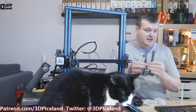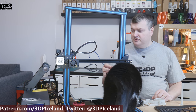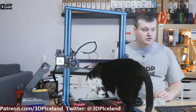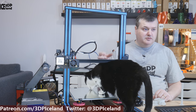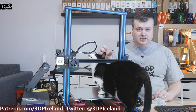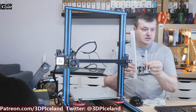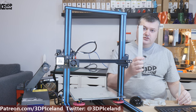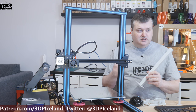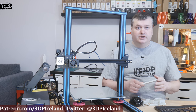I started to notice that when beginning a print, the heat bed would not heat up. I went to the back of the printer where the heat bed connector goes into the control box and moved it a little, thinking maybe I hadn't plugged it in properly — though it has a locking mechanism that turns and locks in place. I moved it a bit and got one print going successfully, a scaled-up resonance test. But after some more prints, the bed lost current again and cooled down mid-print.